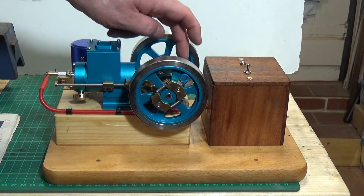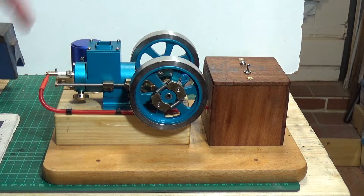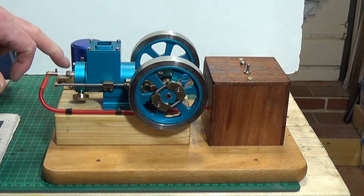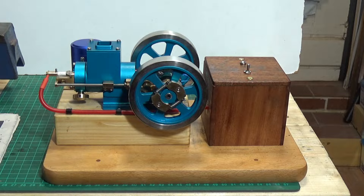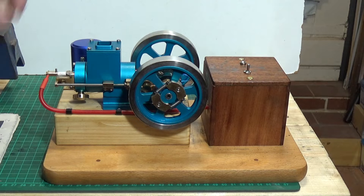So it's always a good idea to scrape the anodizing off so there's a little bit of bare metal for any earth to attach. I did the same thing with the plug — around where the plug goes in, in order to get the outside of the plug well grounded, I scraped some of the anodizing off, because otherwise it could well not be making a connection.